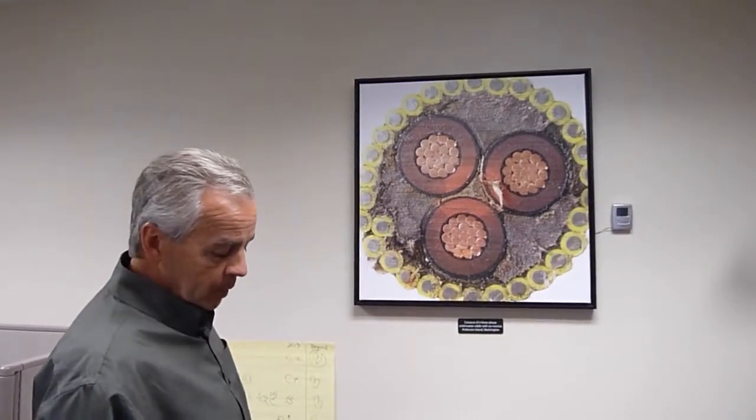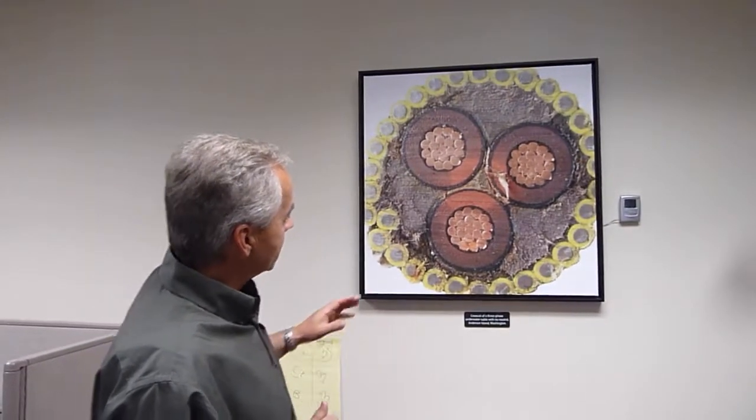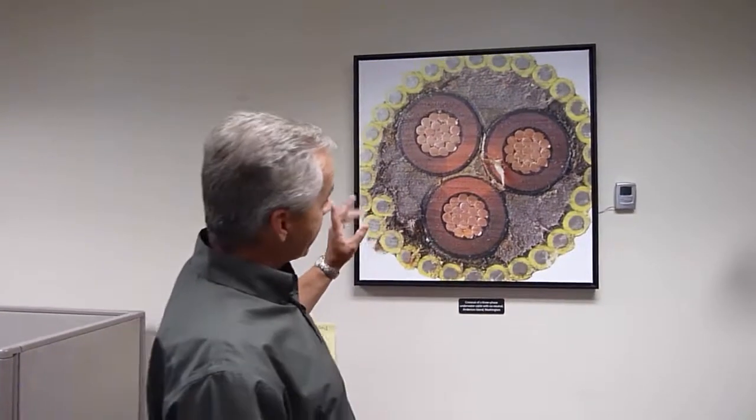There's a long story associated with that too, but the short version is that after we got through and started doing some analysis, we found out that in the subsea there's a bacteria that really likes to make acetic acid in an anaerobic, non-oxygen environment. So guess what you get when you go into the mud underneath the ocean? It's an anaerobic environment. So you get these bacteria feeding on stuff that's there and making acetic acid, and acetic acid dissolves copper. So all the copper neutrals are dissolved by basically these bacteria. And that's something that we didn't previously anticipate. Really bad idea to let thin copper foil come in contact with seawater.